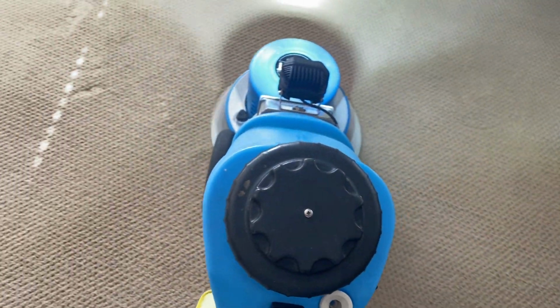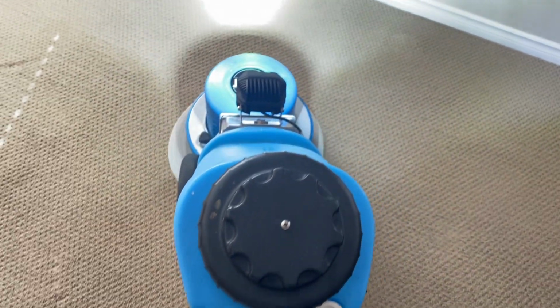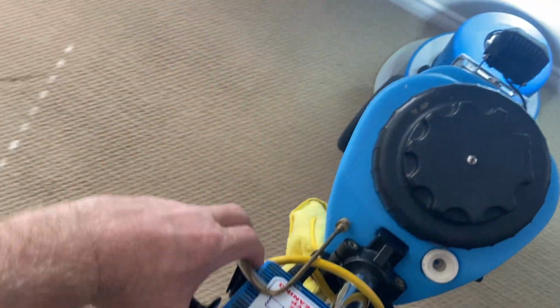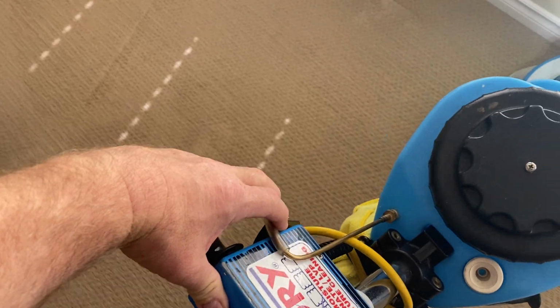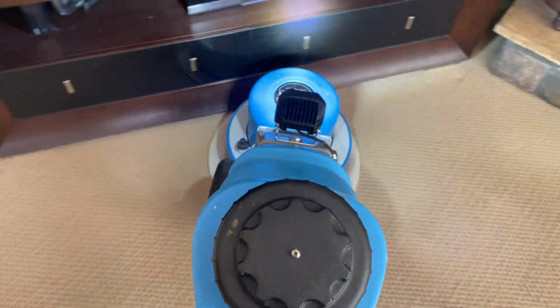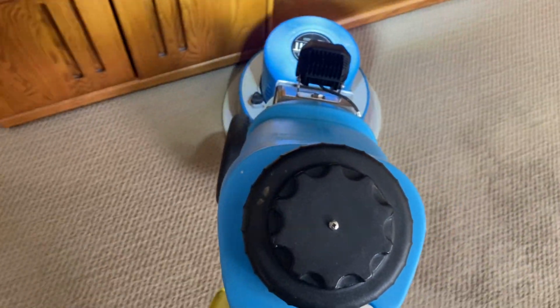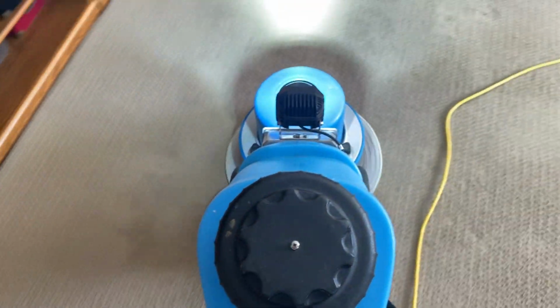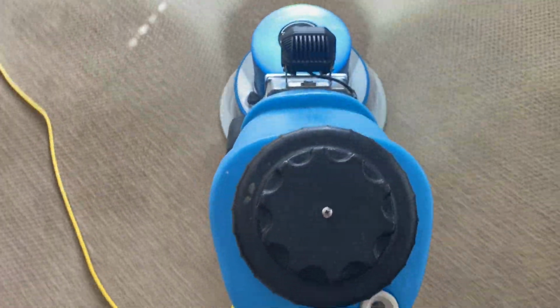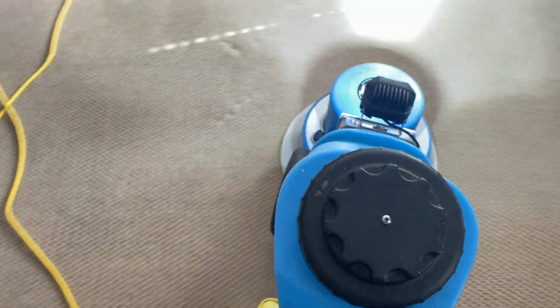And then of course 300 RPM gives you way more than that, which at least technically is going to improve the cleaning power and speed. I don't know that it would really make all that much difference for residential work, but for commercial work, you can really motor along very quickly. With my Hawk 300, I did a video not too long ago where I cleaned over 3,000 square feet an hour with it. And it would definitely do more than that, so you can really move is what I'm getting at with these machines.